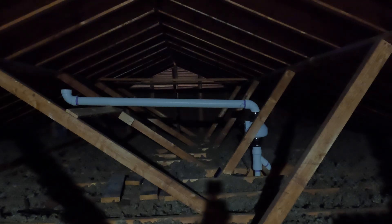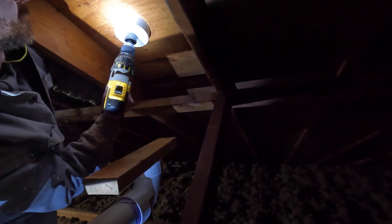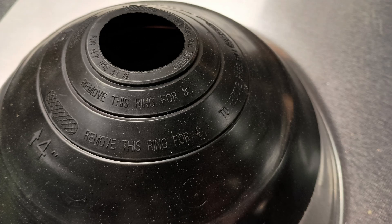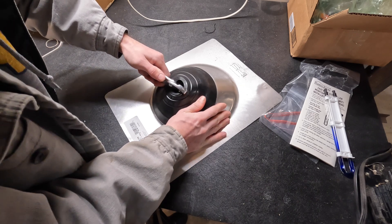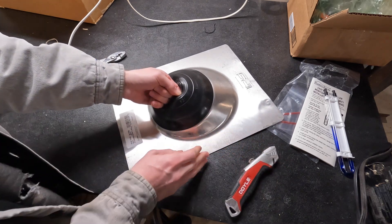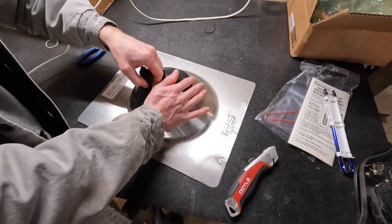I ran the pipe towards the back of the house after it exited the fan because I wanted the roof protrusion to be rear of the ridge line so it wouldn't be noticeable. I dropped a plumb bob to find center and moved my mark up a little to account for the angle I put in the horizontal run for accommodating drainage. I drilled through with a 4-1/4-inch hole saw — you have to drill perpendicular to the roof; if you try to drill straight up vertically, the saw will jump. The flashing I bought can fit multiple size vent pipes. The way it's marked indicates you can pull away sections to size the boot for your pipe. I ended up getting it started with a small slit with a utility knife and then peeling the rest away. It wasn't super easy so I'm glad I did it on the bench instead of on the roof.